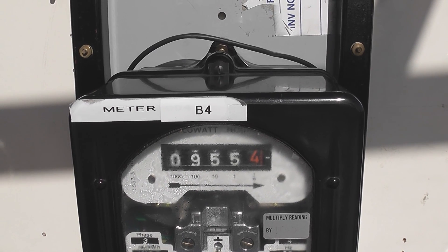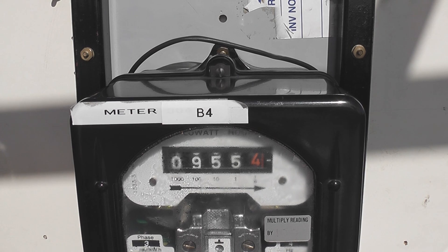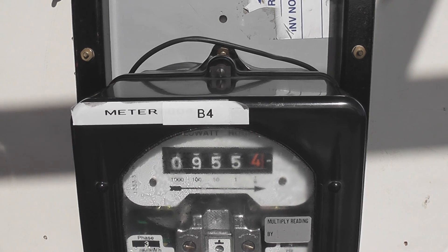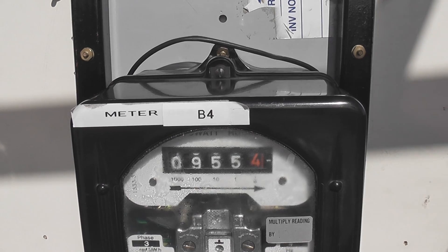I may have smoked out this energy meter a little bit, because I had over 2kW load on here for 2 to 3 minutes on a 3A coil, which is not ideal. I just noticed a little puff of smoke coming out of the meter, so I may have cooked one of the coils.